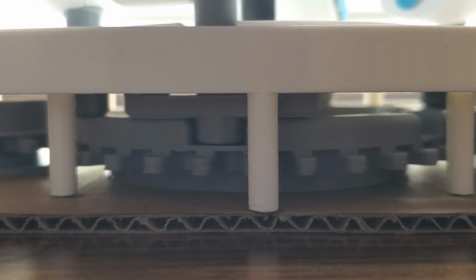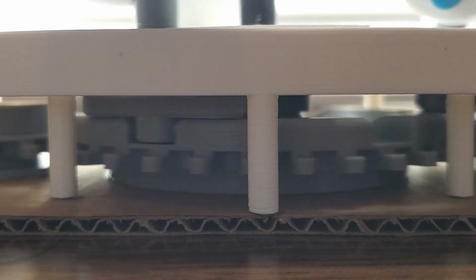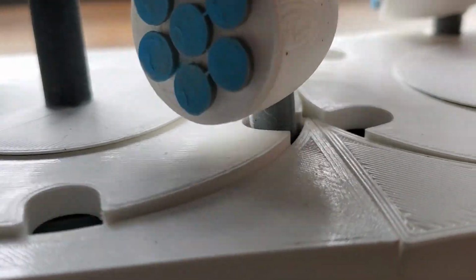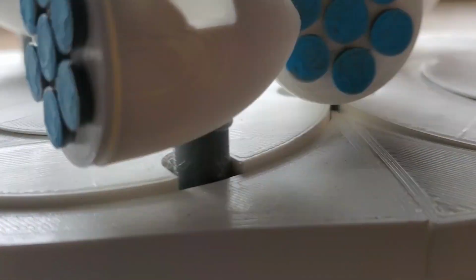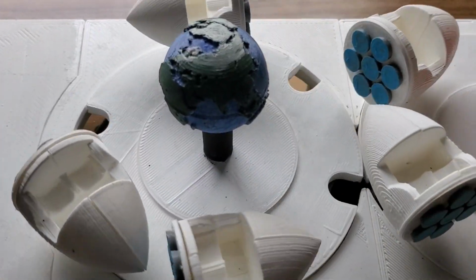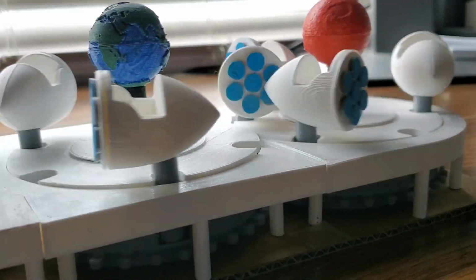That's the switching layer. In much the same way, these gears contain a slot for the vehicle assembly to slot and clamp onto as they go around. This is the loading layer. Finally, we have the turntable surface that rides along with the motion of the vehicles and contains the patterned slots that align with the handoff points to let the column slide over. This is the concealment layer. So now we can put it all together.